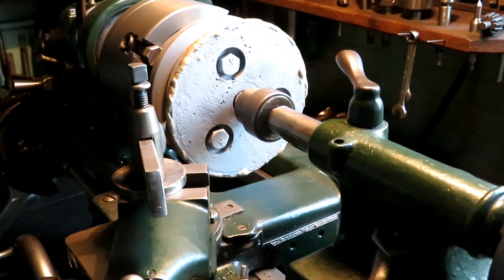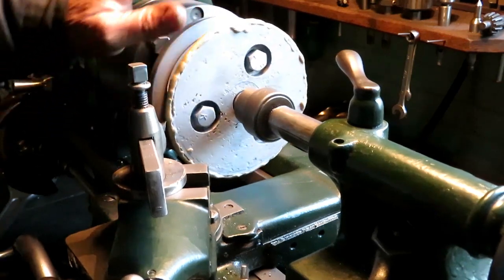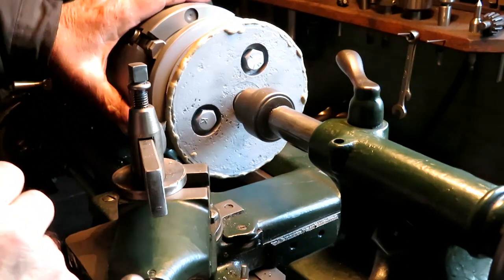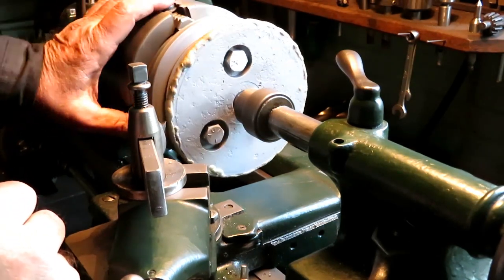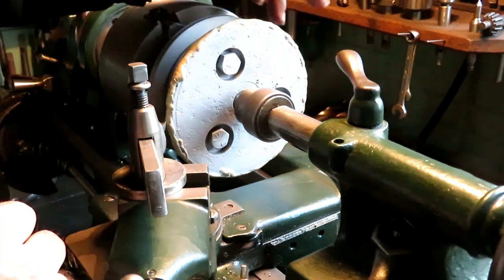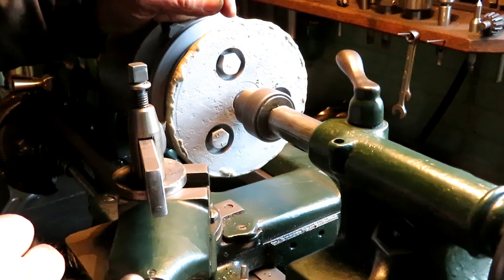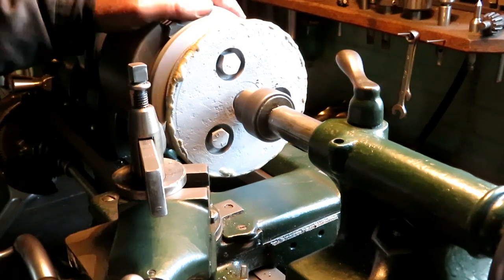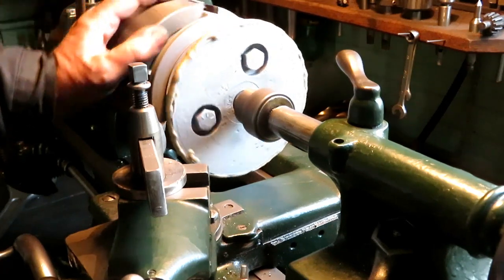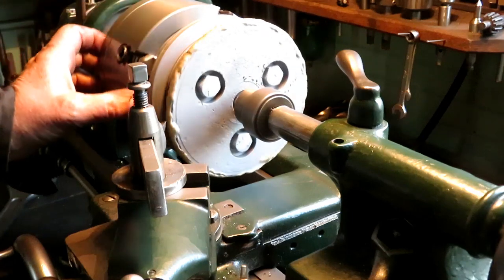Of course, this being cast iron requires preheating and a lot of heat to get the bronze laid down on there. But once you've got it on there, it's pretty easy to build it up in spots without heating the whole piece up, because all you're doing is just fusing into the brass that melts at a lower temperature. And so I think I'm way up above 6. I'm going to try turning it and see how it cleans up.